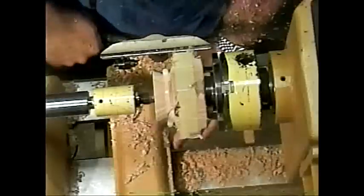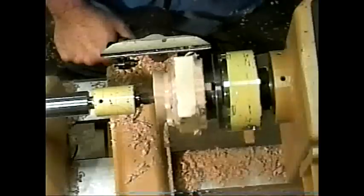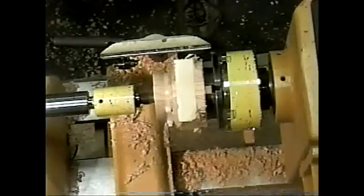As long as they're exactly the same. Yes, exactly the same thickness. It's going to get cut down into round, right? And even when you slice it, if you don't slice it perfectly, it's still going to come back together as long as it's the same piece of wood. But if you get much variation in it, when you bring it back together, the sizes will be different.